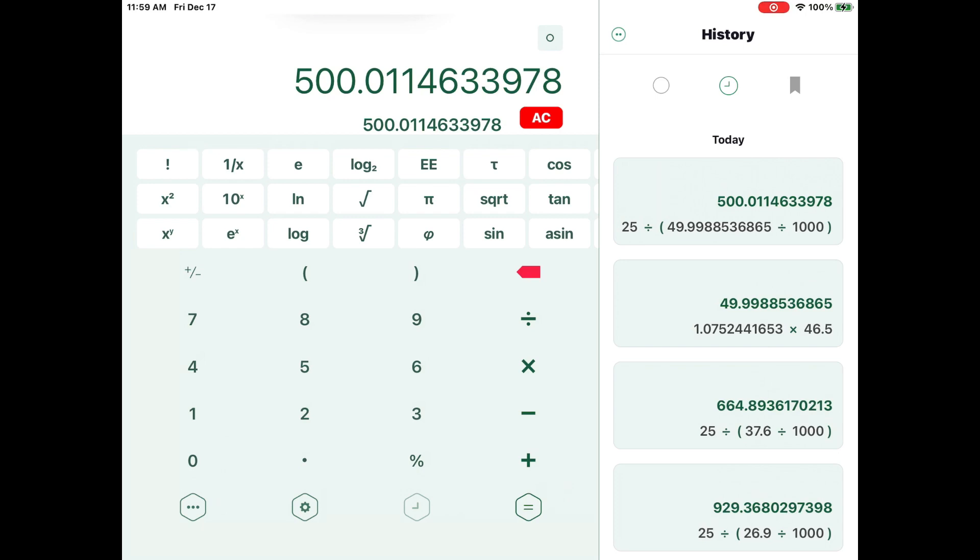Based on the calculations from Mr. Harris, they appear just a little conservative for smaller transformers. Keep in mind this is just one example where I actually know the wire gauge, so a multiplier of 46 or so may not be appropriate for all transformers. But it gives you a baseline to work from when trying to estimate the high voltage capacity of a small transformer with an unknown rating. I appreciate everyone out there watching. For those that celebrate Christmas, I hope you have a blessed Christmas and a happy new year.